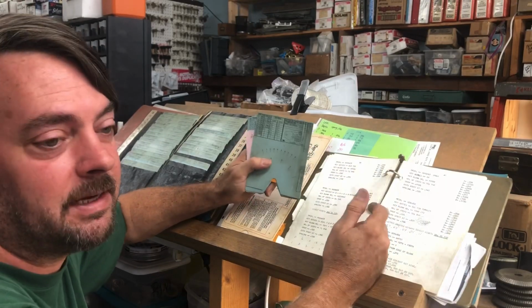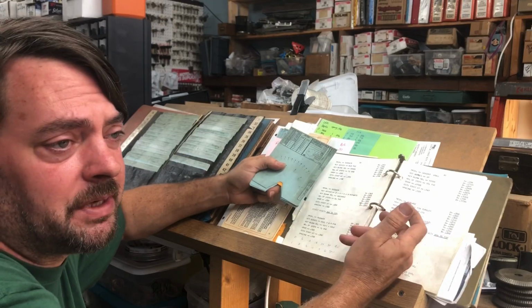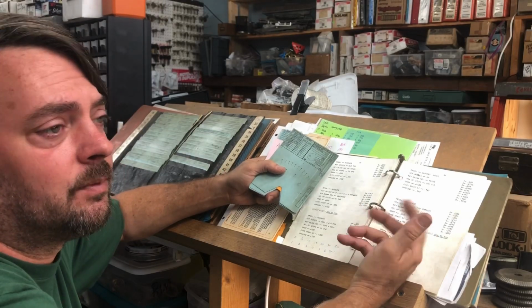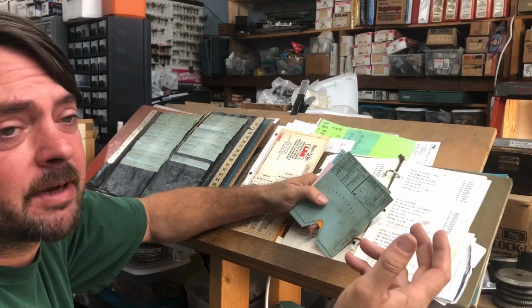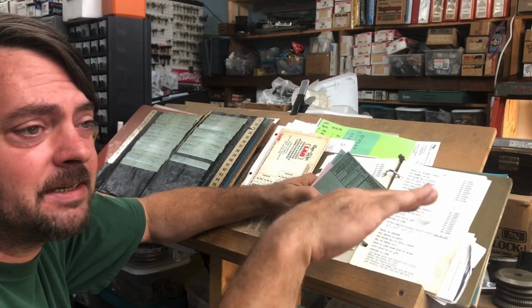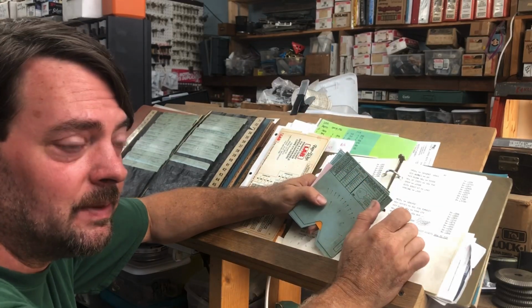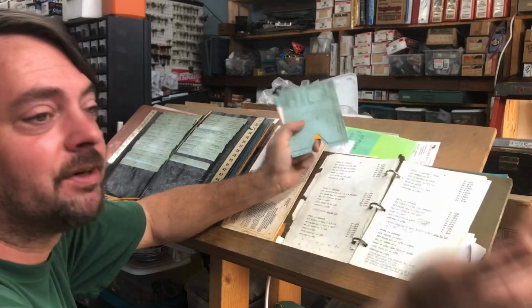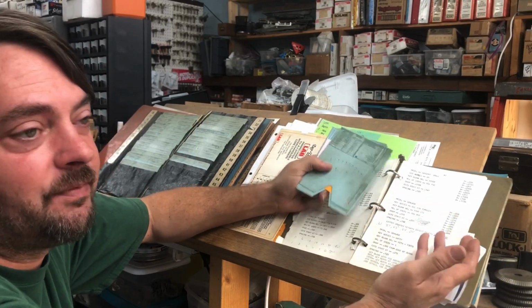Literally, all we're making this key for is to just check the operation of the lock, which we could do with another cylinder, but it's here. We're going to make the customer a key. So we could be wildly non-specific about it. As long as the spacing is correct and the pins are resting where they're supposed to, you could screw the depths up all you want. Doesn't matter. You can put whatever depths you wanted in there and just fill it, which is what we're going to be doing anyway.